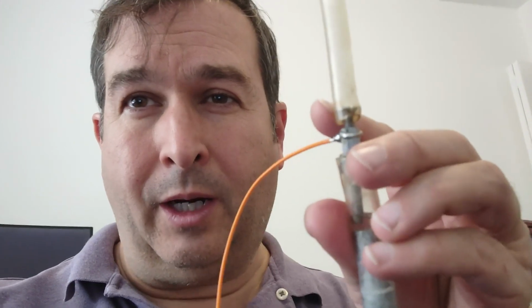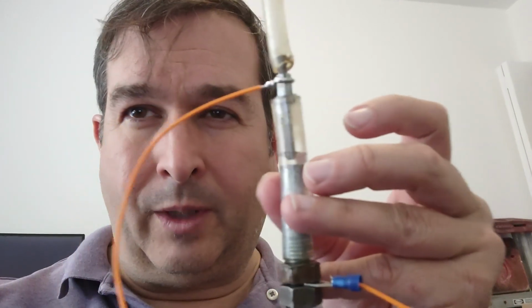We'll try to measure the breakdown electric strength of water using a different method with this spark gap, and using higher voltage, because higher voltage is nice since then you can use spark gaps with it. The other thing is it was blowing my plates apart when I was doing some high voltage sparks on that. So I can put less energy and a higher voltage and get a bigger gap. Anyway, we'll measure what the dielectric breakdown is using a different method and higher voltage.